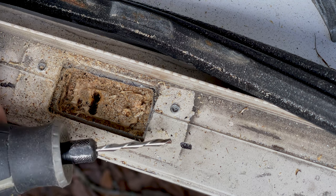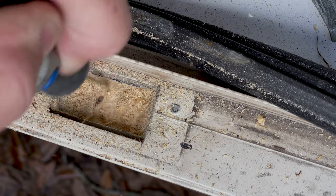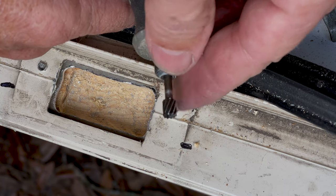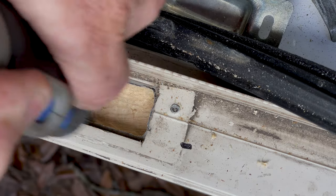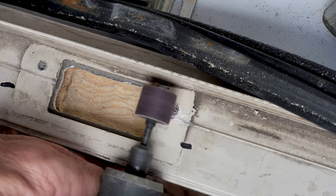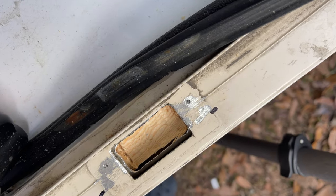I noticed the wood was starting to burn a little, meaning my bit was getting old, so I switched to a new bit which quickly cut through and finished removing all that wood to the proper depth. I then switched to a metal cutting bit to help clean up the wood at the bottom of the hole and clean up the edges of the aluminum I had cut earlier. I also used a sanding drum to cut down a ridge to get a better seal between the strike plate and the door frame.